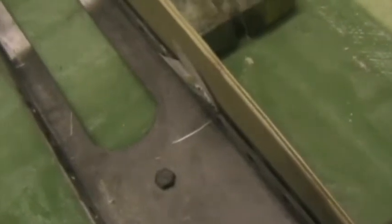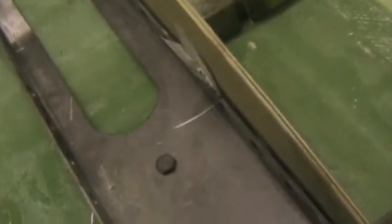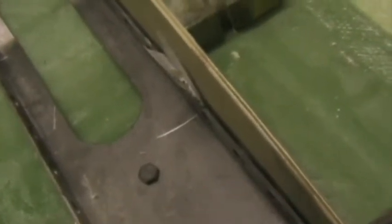To leave space for the fiberglass that's ultimately going to be in this area where the undercarriage channel is, I've put in 3 millimeter spaces, offcuts of perspex in this case, between the plywood and the bulkhead, so as to leave a 3 millimeter gap in there. There are the other spaces.